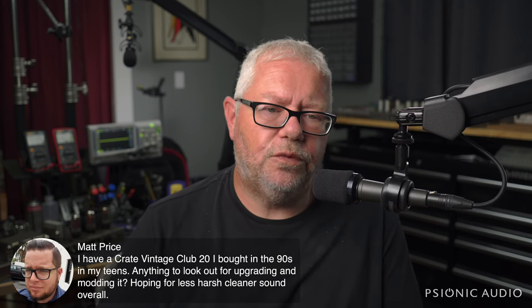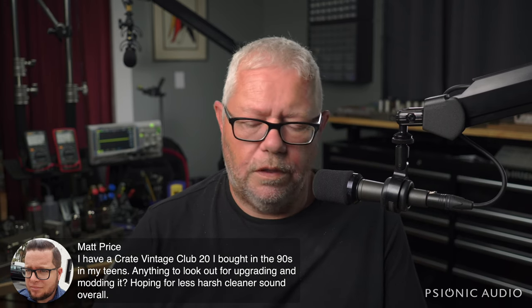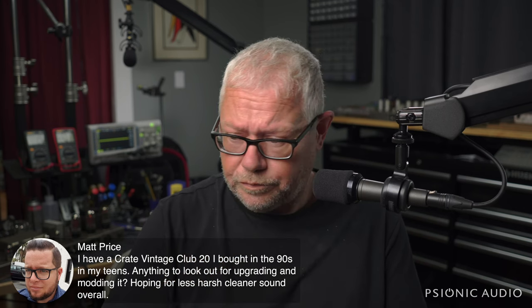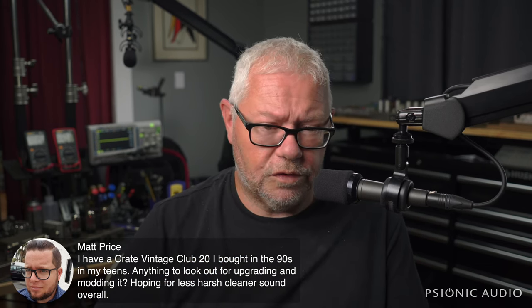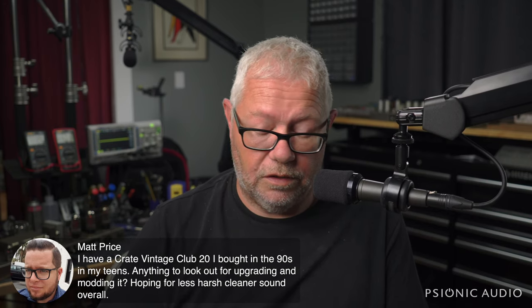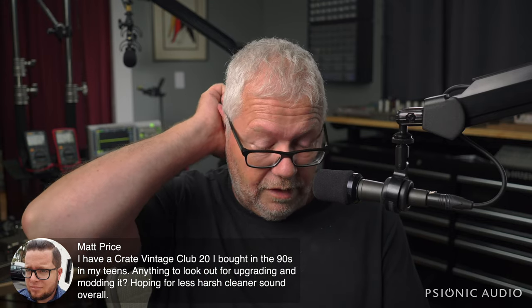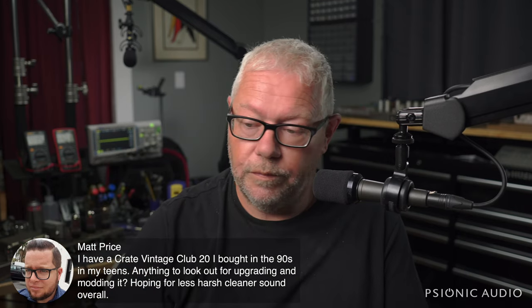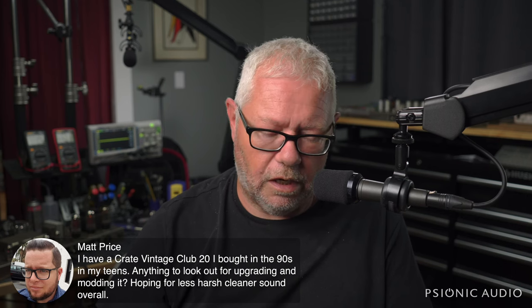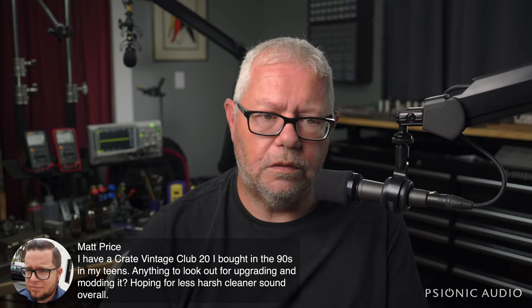Hey, the vintage Club 20s are great, Matt Price. For the price point, they're fantastic. The only things to look out for on those, like any PCB amp where things are mounted, the pots are mounted to the board, you might eventually need to reflow some sockets. It's from the 90s, so it's at least 30 years old. Probably time for a recap. All the electrolytic caps in there should still be available, mostly radials. There might be a couple of axials. You can still find the axials for the cathode bypass caps. Just be careful working on a PCB. Learn how to do it.